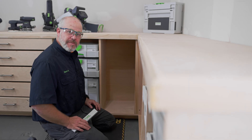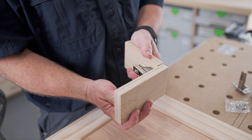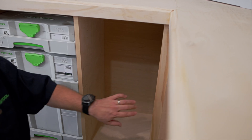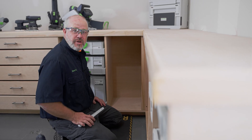With the opening prepped, I can go ahead and grab measurements for my door. I'll be using full overlay hinges, and based on the recommendations of the manufacturer, that determined the actual size of my door. Your hinges may vary, so just double-check those recommendations.